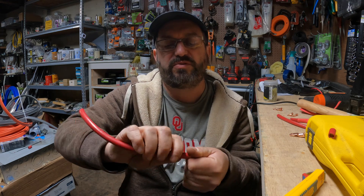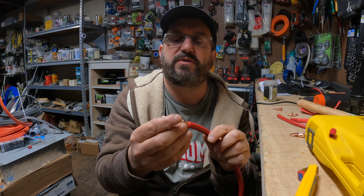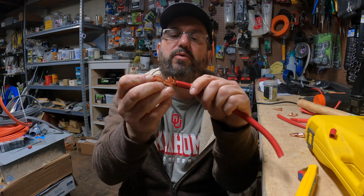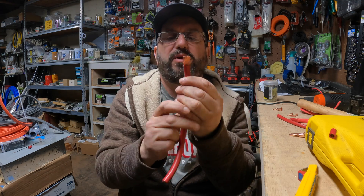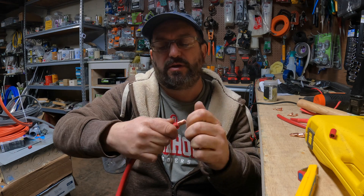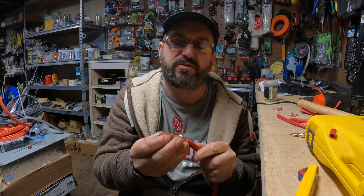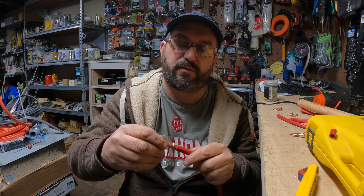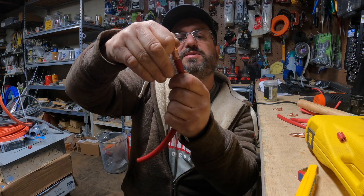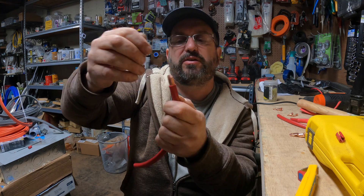From here, you twist the wire a little bit. I'm going to double check and make sure it fits nicely. You don't want the strands splayed out — you want all of the strands to fit underneath your lug. So I twist it a handful of times to get a nice tight bundle that'll fit underneath. I'm just going to dry fit it here to make sure we're good. You can see there's a small gap between the lug and the insulation, which is fine — you just wouldn't want insulation underneath the lug.